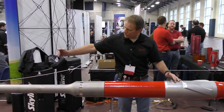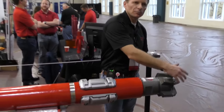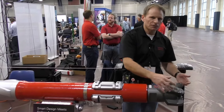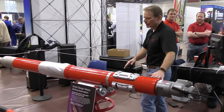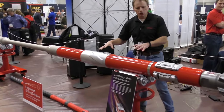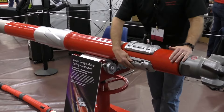We have fluid flowing through the entire tool assembly. The fluid comes down through here and out the bit. Once it comes out the bit it's there to keep the borehole clean by taking away all the cuttings and also to keep the borehole temperature down. That fluid flow also turns a generator which provides power to the electronics inside the tool.